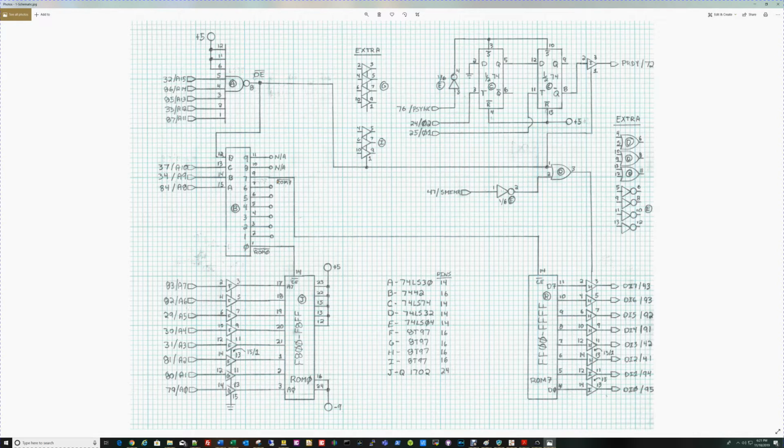Or I got to make sure I'm thinking about this right. Yeah, that's 8 or higher, which says these outputs will become basically active. So this guy low, basically the chip is enabled to pick one of the 8 outputs down here. And then depending on the state of A10, A9, and A8, it'll take one of these output pins low. If they're all zeros, it'll enable ROM 0. If we have a 1 here on A8, this pin will come low and it would have picked ROM 1, ROM 2, ROM 3, all the way up to, they're all ones, ROM 7.